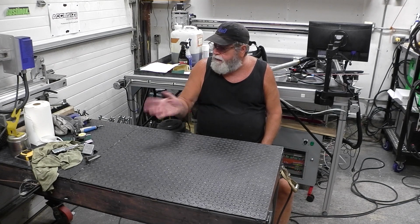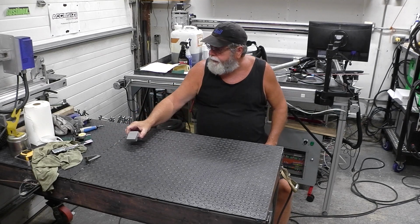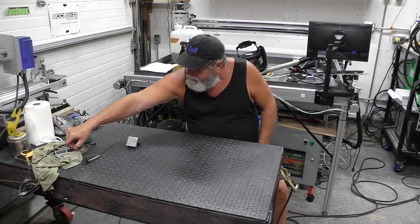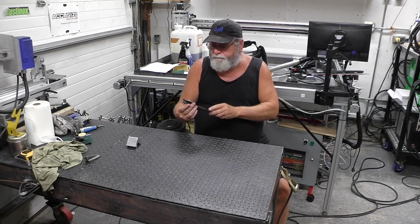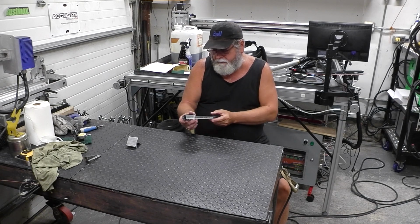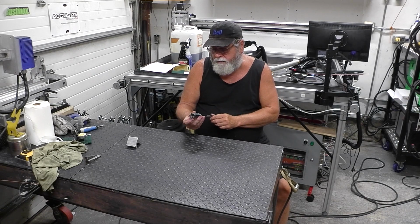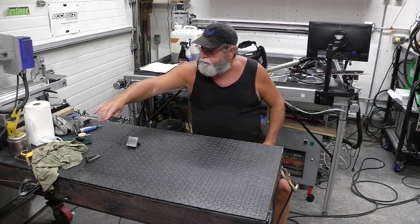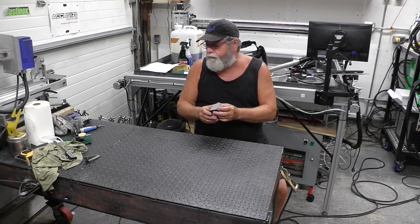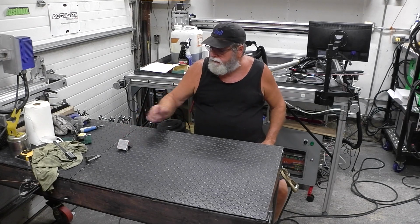So anyways, I've got a little bit of milling to do on this quill stop, or carriage stop I mean, and we're gonna mount this little dial indicator. I got this from iGauging. This was sold at Busy Bee Tools in the next town over there, Pickering. So we're going to install that. So when I'm doing some boring, I can put that on there. I'll cut a little flat on this and mount it to the quill. I got to drill some holes, and like I said, I got a little bit left to do.